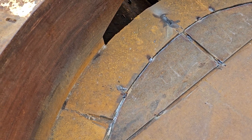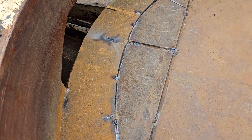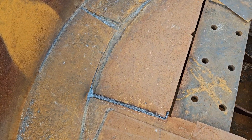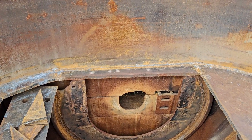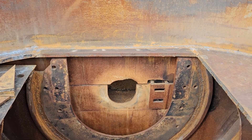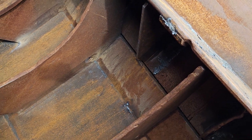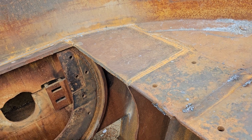Here we go — this is a tub I've been working on for a couple months. I still got some welding to do on this half inch here, got it all nice and tacked. I'm getting ready to open the deck to gouge a crack that appeared there. I gotta open the deck so I can pull that one inch down when I weld the bottom side of it. I got some gussets down here that need welded.